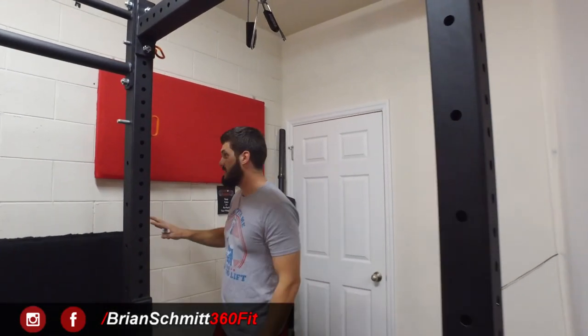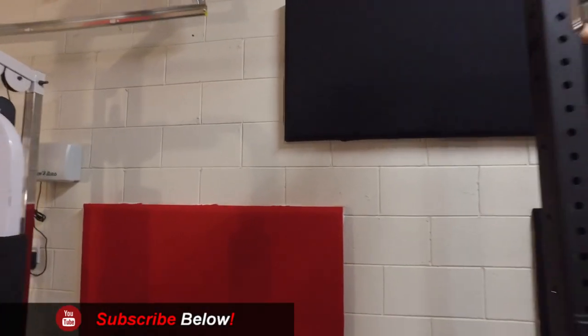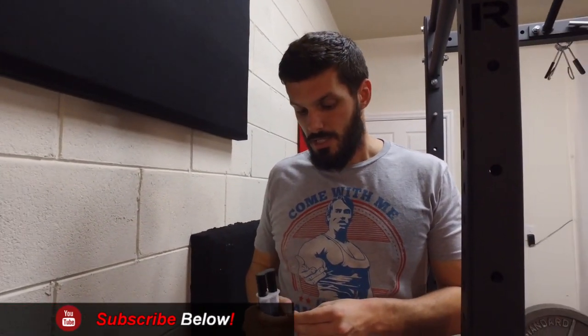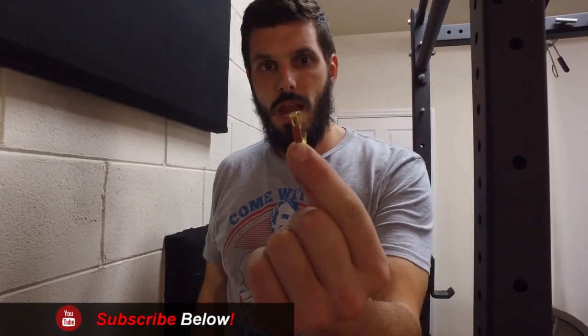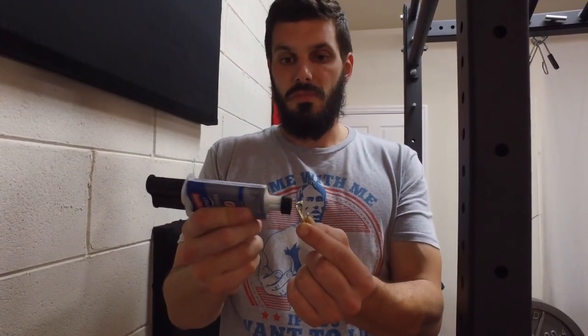For the wall panels, we tried many different things to get them to stick. Instead of going over what didn't work, we'll focus on what did — and it's a very simple process that allowed us to avoid drilling into the concrete. We took a picture frame hook and attached it to the concrete with a metal-to-concrete epoxy. We put the epoxy on, placed the hook on the wall, let it set for about an hour, and then we were ready to hang the panel using the D rings on the wooden frame.